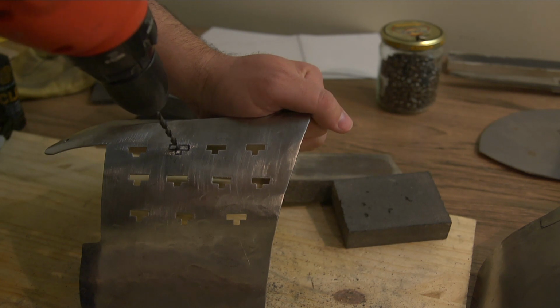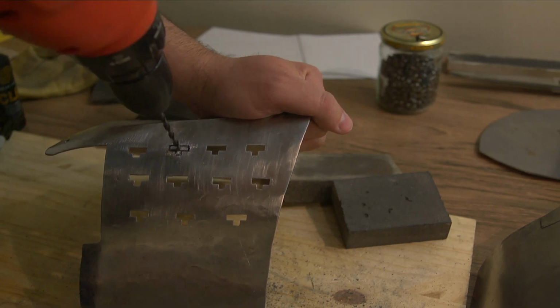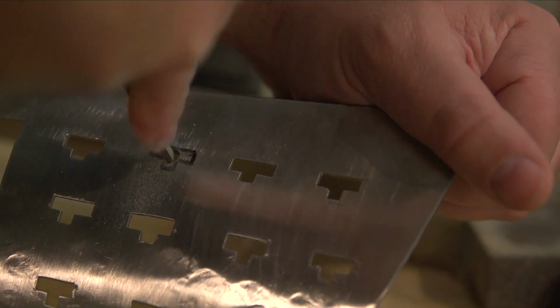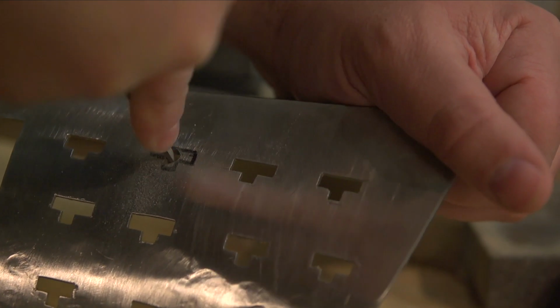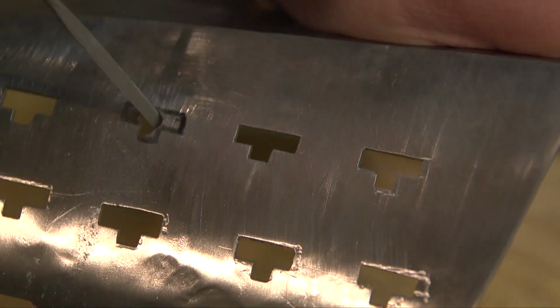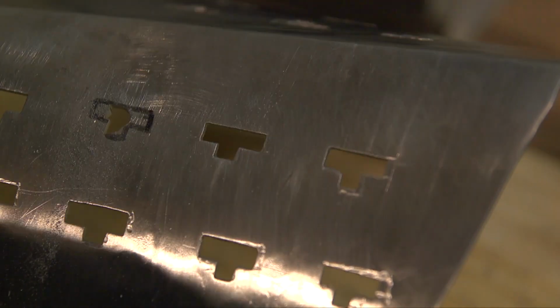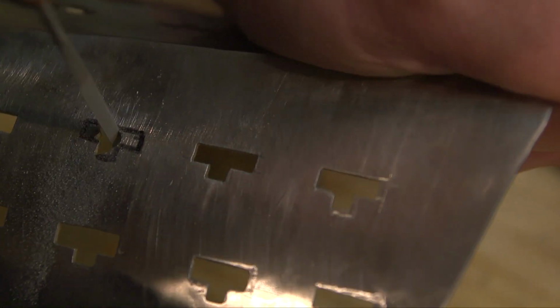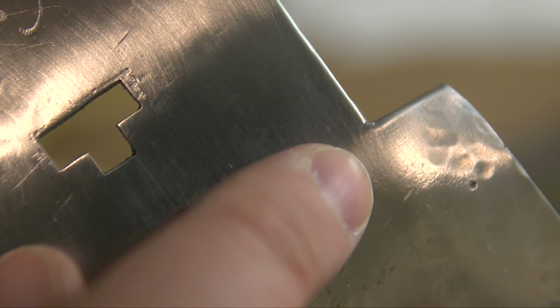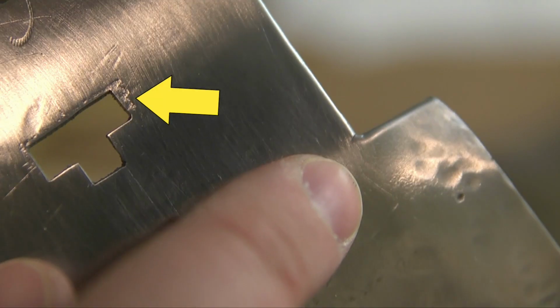So I did break my own rules, but they weren't technically my rules until just now, not in 2018. Having said all that, when you are ready, you can drill the holes for the breaths and use metal files to remove the metal. It's easier than it looks. It took about 15 minutes per hole, and that does add up. You can be as precise as you'd like to be. Historically, though, they don't seem to be too perfectly measured or spaced, at least to me. Next time, I definitely won't be drawing these shapes on with a Dremel. Permanent markers like Sharpies are going to work better because they don't leave behind unnecessary marks.